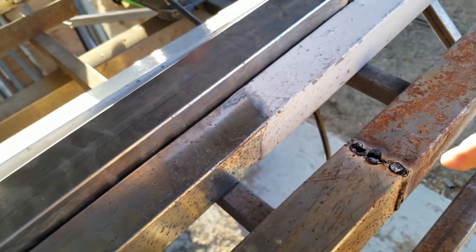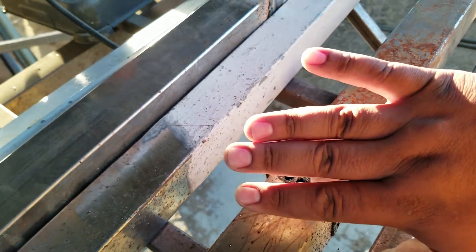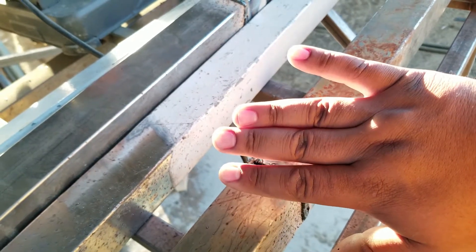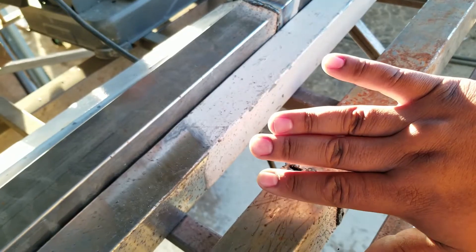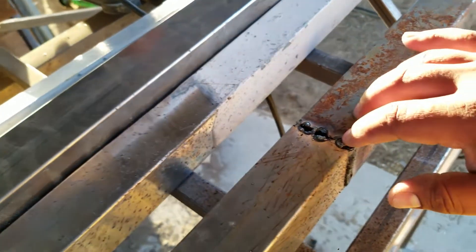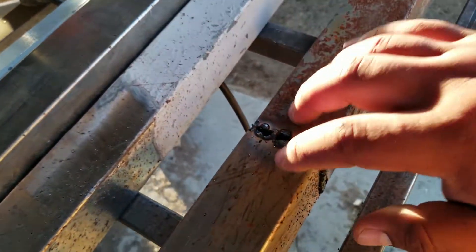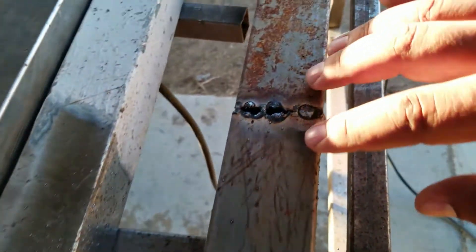Number one is too wide of a gap. If you have two pieces of steel and you don't have them exactly butted up against each other, and you have kind of a V groove, toward the open side of that V groove you're going to have more of a problem and probably create more holes than on the smaller side of the V groove. The closer you can get materials together, the better your welds are going to come out and the less problems you're going to have.